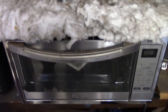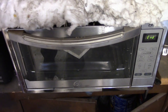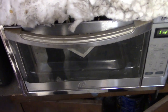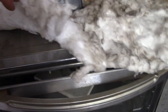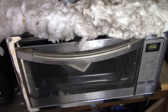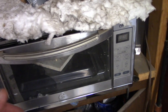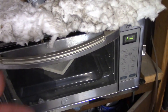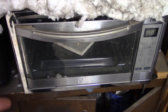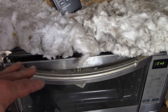Now, these toaster ovens do have a little bit of a bad rap in terms of some of the characteristics of them when it comes to tempering. But there are some things that you can do to correct it, and I'll show you that. So the first thing is, the bottom line is the way these things are built is exactly the same way that those high-priced furnaces are built. The difference is, it's a metal container with a digital controller and a set of firing elements that heat up the inside, which is exactly the way those even heat or any of the paragons, any of the heat treating ovens work. This is just a much scaled down version.